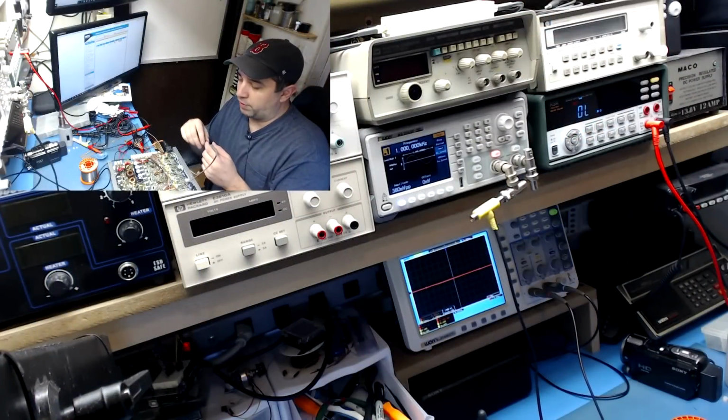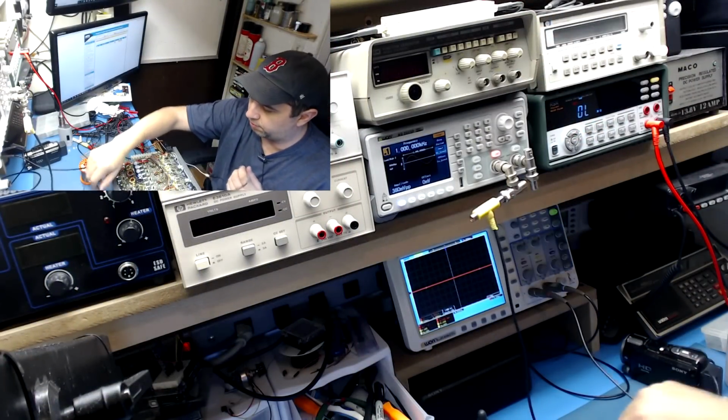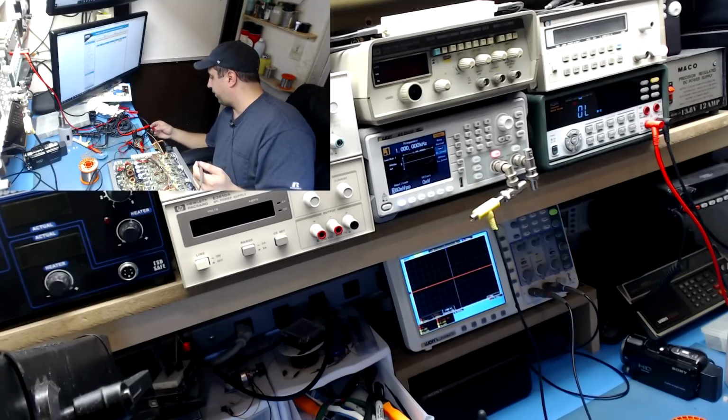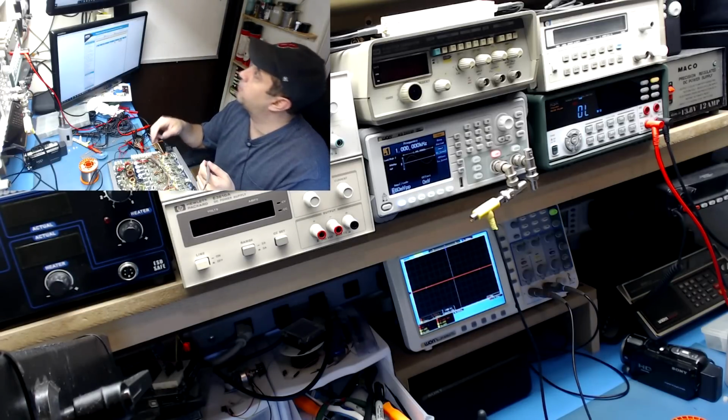Okay, so this is the moment of truth. We're going to find out if that channel has come back. We're going to let out the smoke. One of the two, I don't know. Yeah, let's power it up. And we're drawing 1.8 amps, so it's not running away, so I have hope here.